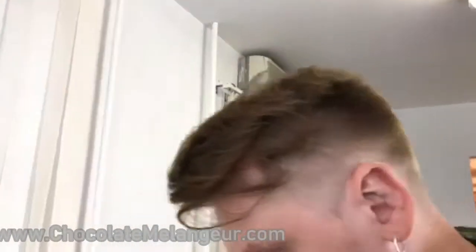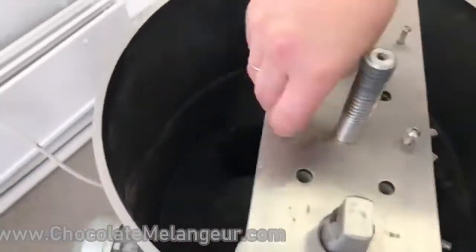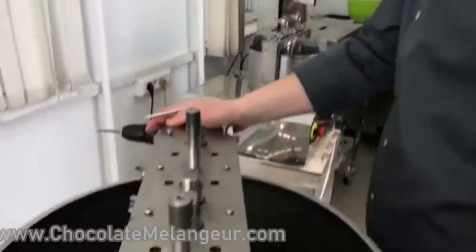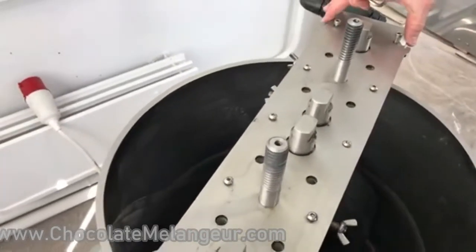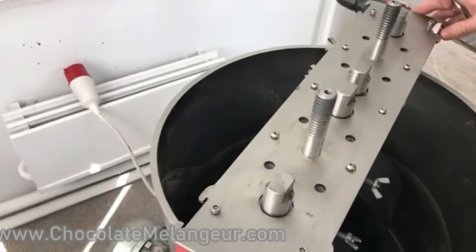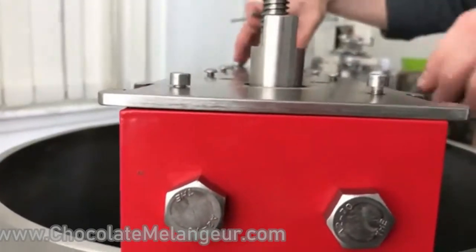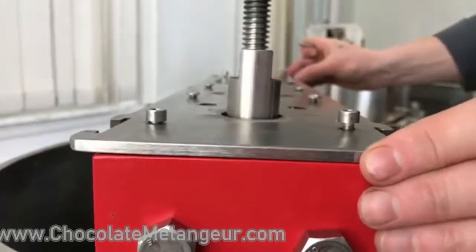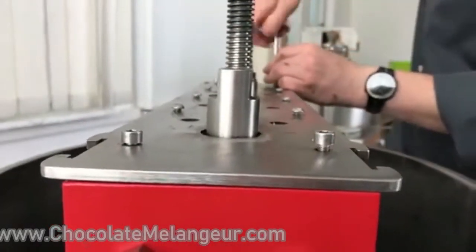What is next, Sasha? Now we will assemble the bolts. During the assembling of this part, it is better to fix all bolts in the holes, so you will not be able to damage the grooves inside. You can see here that all bolts are fixed in the holes, but I did not fix them too hard. First, you need to fit all bolts in their own holes.